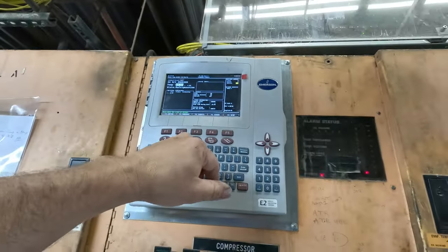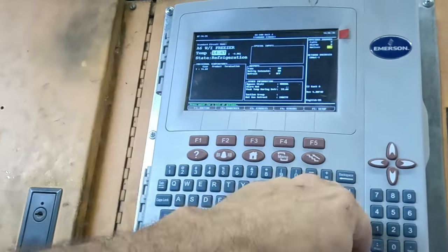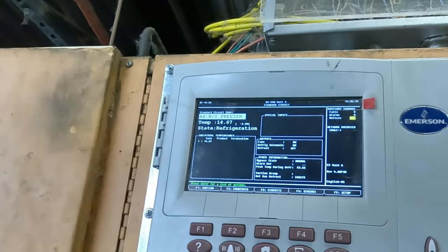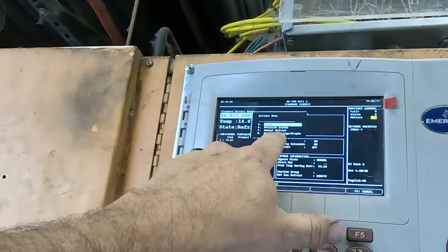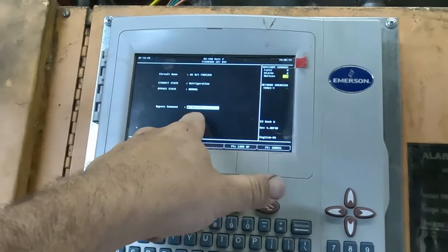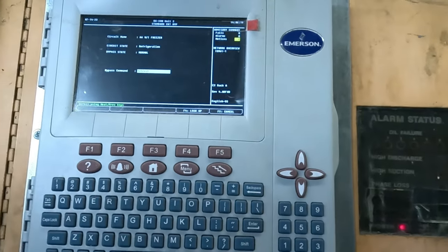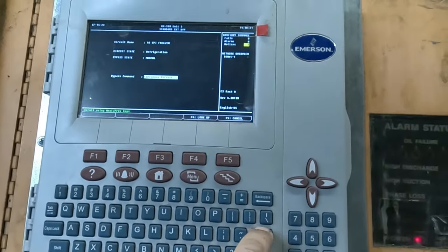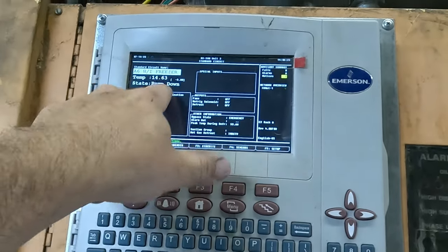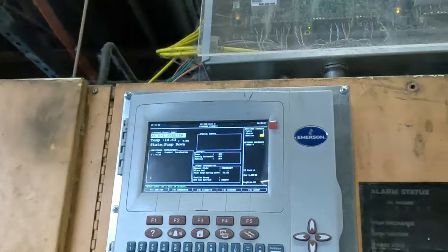So that's what we're working on. I'm going to throw that into a defrost. We're going to have to log in. Now you're in - go to freezer, enter, manual defrost which is seven. No action - hit your next button. This is a big one I wasn't ever told about: previous to next. Go to the next - emergency defrost. That's going to let it run. It's pumping down and then it's going to flip and run hot gas through that thing.